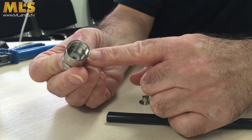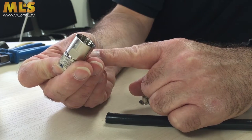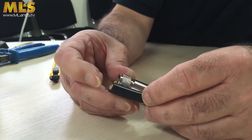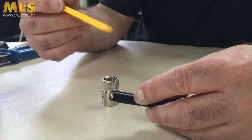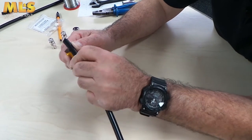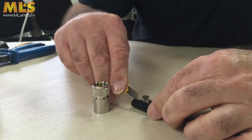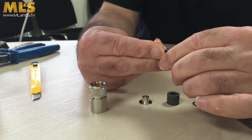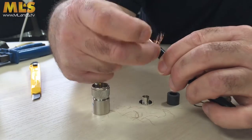I don't know whether you can see, there's a little ridge down inside there. That's where you're going to want to make the inner conductor to... they actually want to take off the sheath too. So somewhere, if you line up the two ends, I would say somewhere around about there. You don't want to cut off too much, it would make yourself too much work. I'm going to start off with this, just on the outside and a little bit down there. Much nicer to work with. So the same as the RG213, we've got the outer braid, which you peel back.